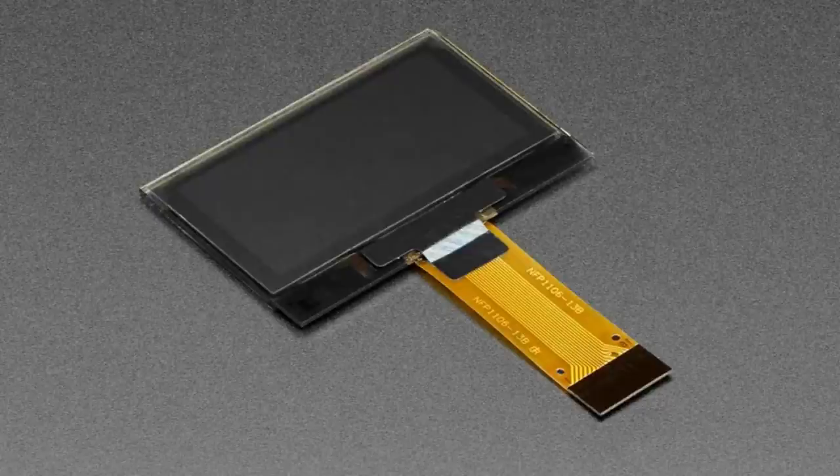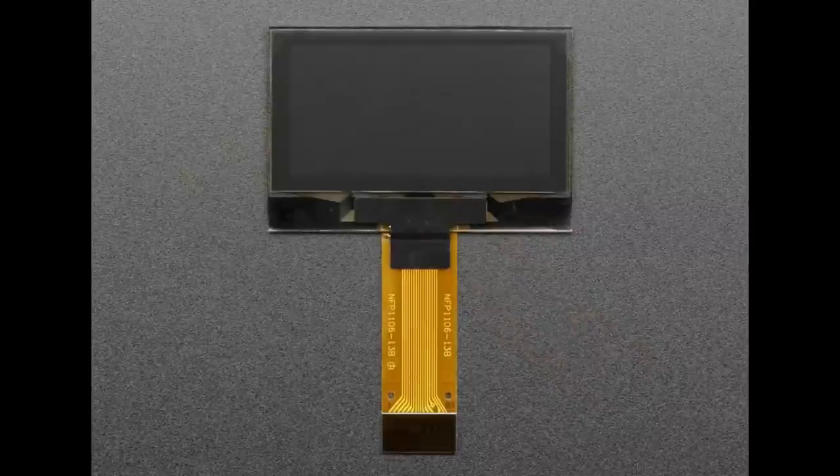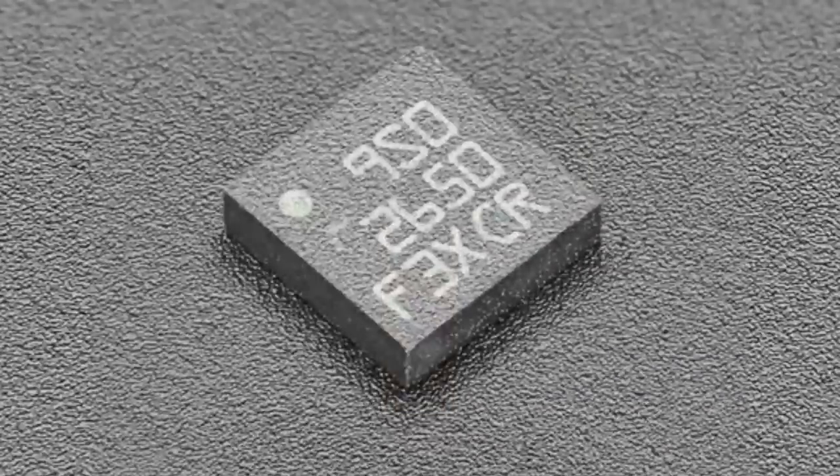Check out the MacroPad PCB files for the wiring, because you do need a bunch of capacitors, a couple of resistors, and you will need to supply it with 9 to 12 volts DC using a little boost converter for the OLED biasing. It does not have a built-in booster. Next up. Okay, so now we have a couple of components that are a little bit weird.